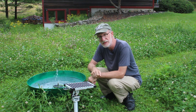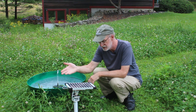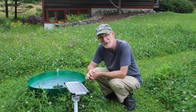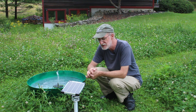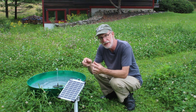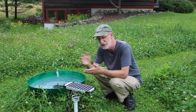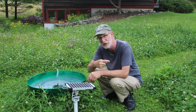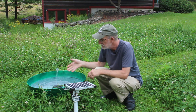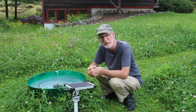To calibrate the sensor, I put a couple of pieces of wide black tape over the dome to widen the shadows on the sensors and give it better tracking. The sky is fairly homogenous right now with no really bright spots, so it defaults to the east to catch the morning sun — that's a feature I designed into the system. Overall I'm pretty pleased. Water level's a little down — I'll top it up later. It's been a fun adventure and I'm really pleased with how the whole thing came out.